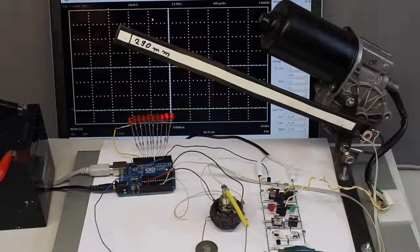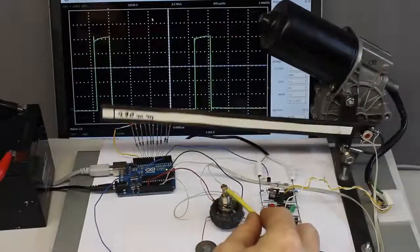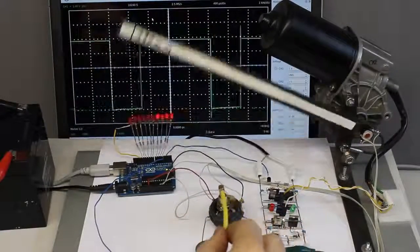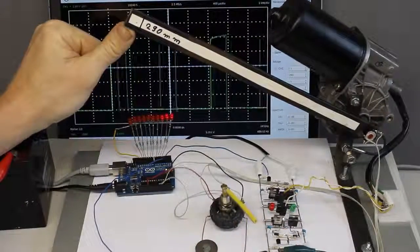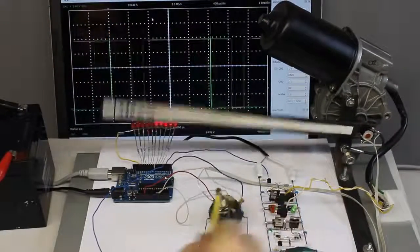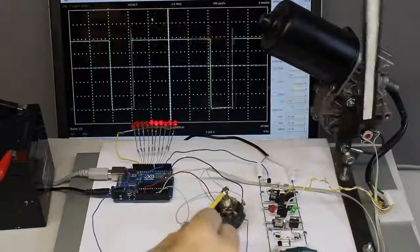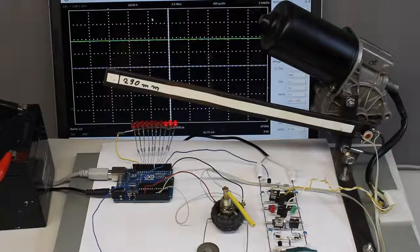A combination of proportional and integral controller raises the duty cycle and so the voltage forwarded to the servo motor whenever the mechanism gets blocked. By software, the integral component of the control circuit can be enabled whenever the servo mechanism stops before reaching the set point or if the rotational speed is lower than expected. Now, the movement of the servo is precise and powerful.